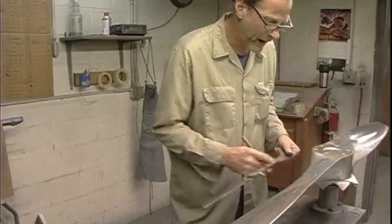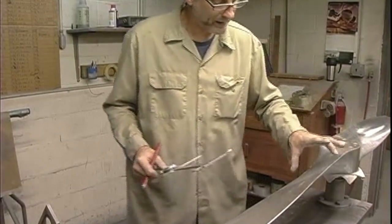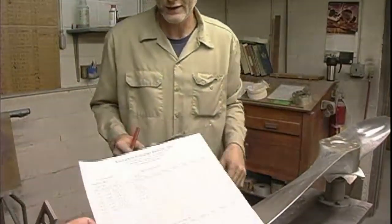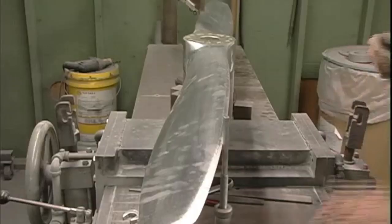Now I'm just measuring, after I've overhauled the prop, the width and thickness of each station line, which will go in the after column, and then you'll be able to see just what I took off. Right, okay, all right. And do the same thing.